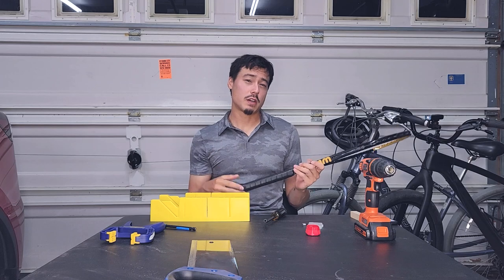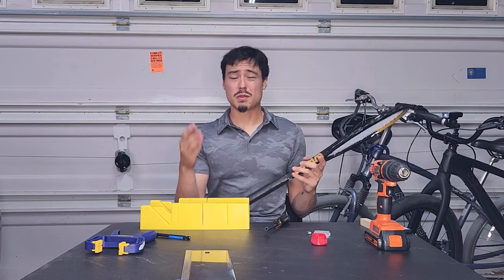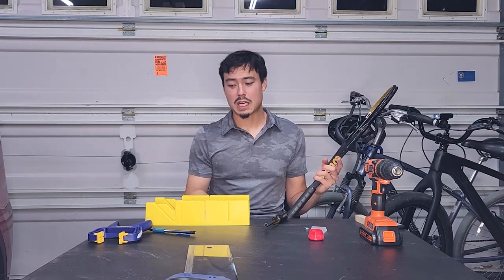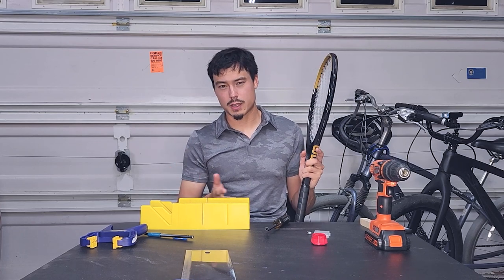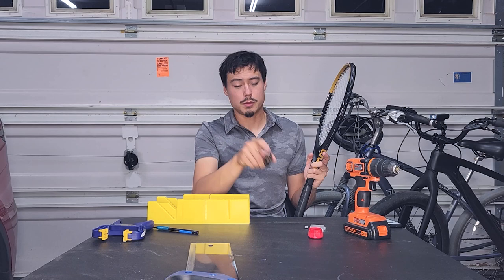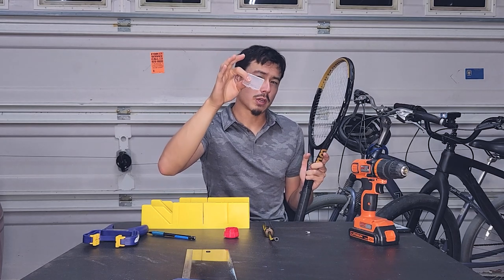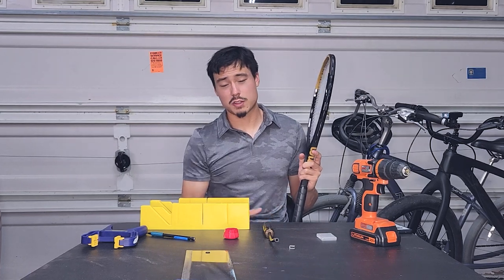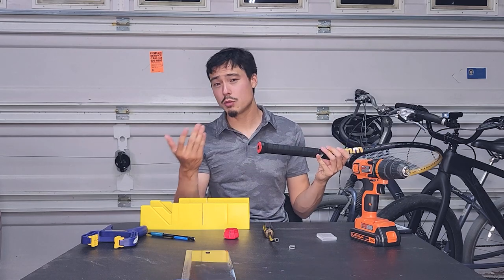I want to show you how I'm going to cut this down to length with some basic tools. I have a clamp, a saw guide clamped to a portable table, a drill, a staple remover, another butt cap in case I want to use it, and some micro drill bits. These drill bits are about the same diameter as an industrial staple, which the factory would use to staple a butt cap to the handle — which we're going to remove in order to cut this.